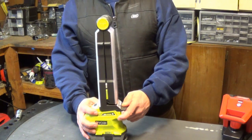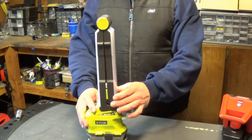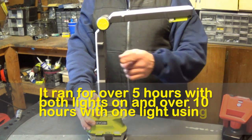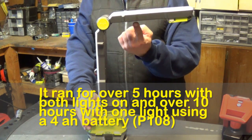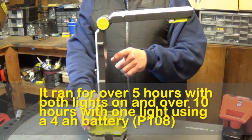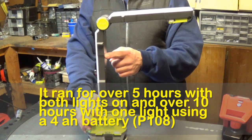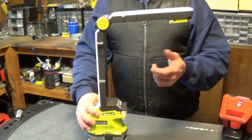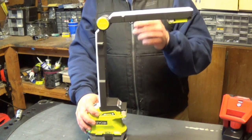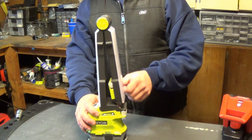When I was doing the endurance test on this — seeing how long it was going to run on a battery — I had it in this configuration. If you're going to run it like this for a long time, just keep in mind that the temperature in this area here and also in this area here is going to be very warm. When I went to check it, I grabbed it and it was quite hot — actually 120 degrees. I don't think it's going to get hot enough to do any damage; it didn't deform the plastic. But maybe give it a little bit of an opening so you get some air through there.